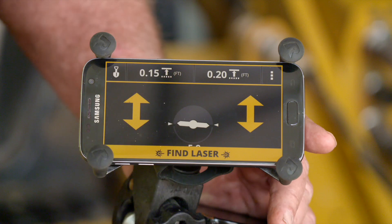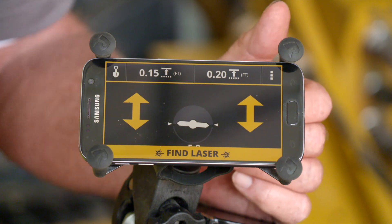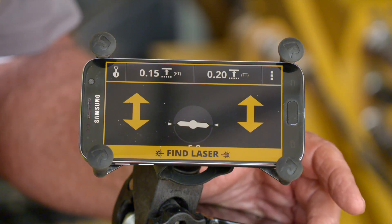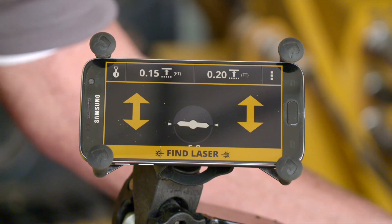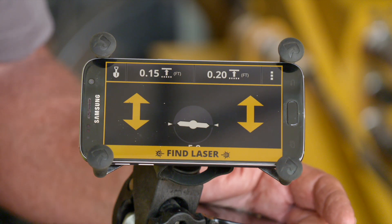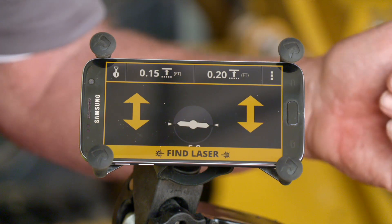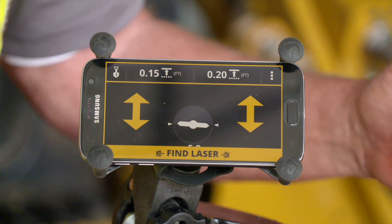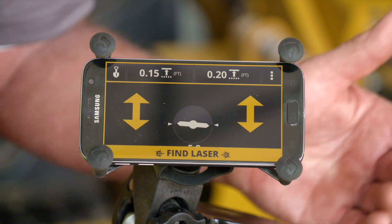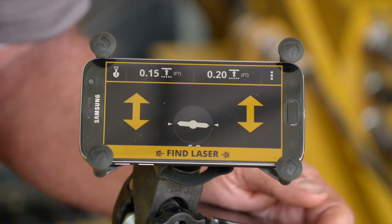This is the screen you'll get. If you set up a bench — say a two or three inch lift with a zero, one, or two percent drain slope using the dual slope laser — all you have to do is get your elevation on your blade, adjust your receivers until they lock on, and that is your set bench. From that point within the machine, you can increment using both the right and left hand joystick to operate the tool up and down, or set it to automatic and it'll run on the zero grade you've asked for. If the blade gets heavy with material, you can increment up, and as you lighten your load, increment it back down and return to your zero point.